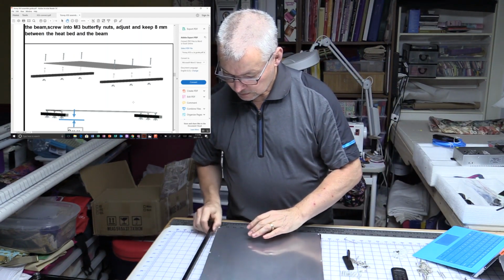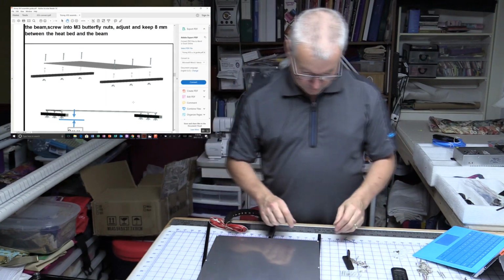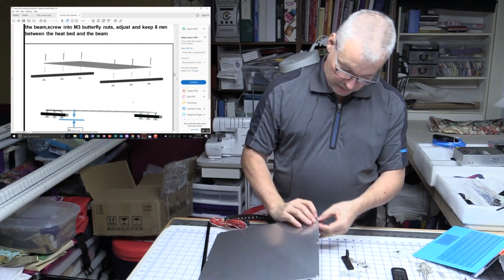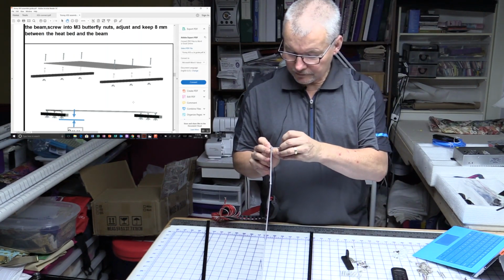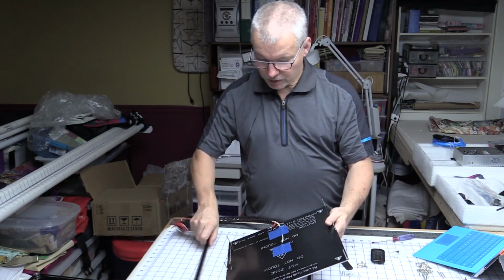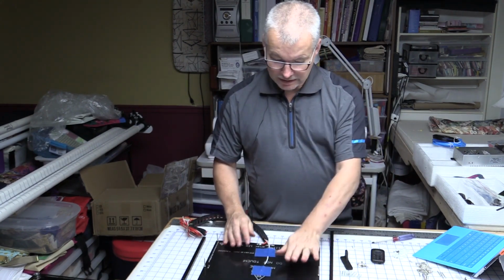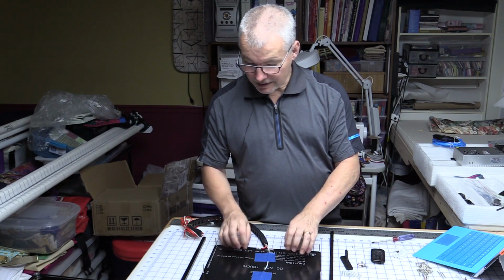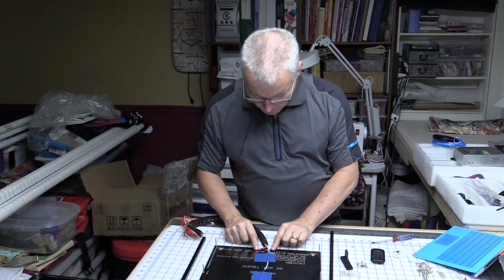Okay. So, first things first, these countersunk screws are going to go through with a nut on the back, according to that. So we'll lay this down. Got to be careful because the wires are pre-attached and soldered on quite heavily. If you do have a heated bed, I have one downstairs that's exactly this model for the printer that I'm building, and we have to solder it. But of course, with a massive heatsink like this, big piece of aluminum, it takes a powerful soldering iron to be able to get that on there, which is probably why they've done it ahead of time.